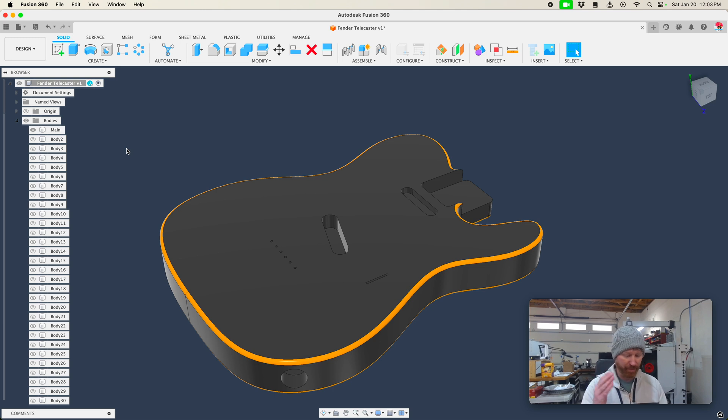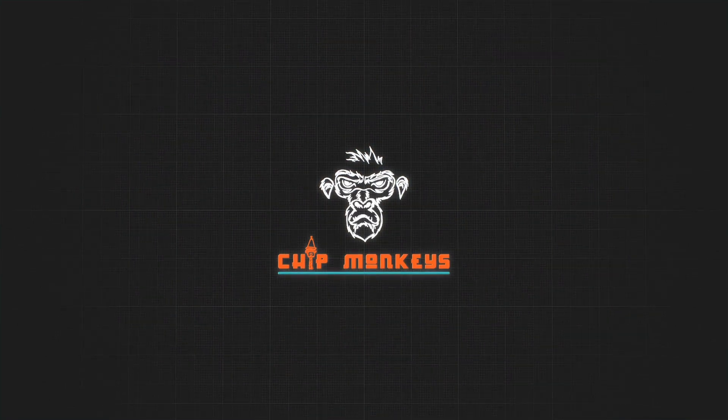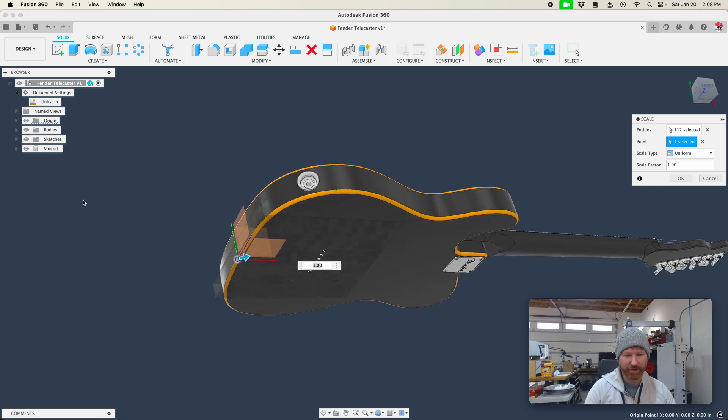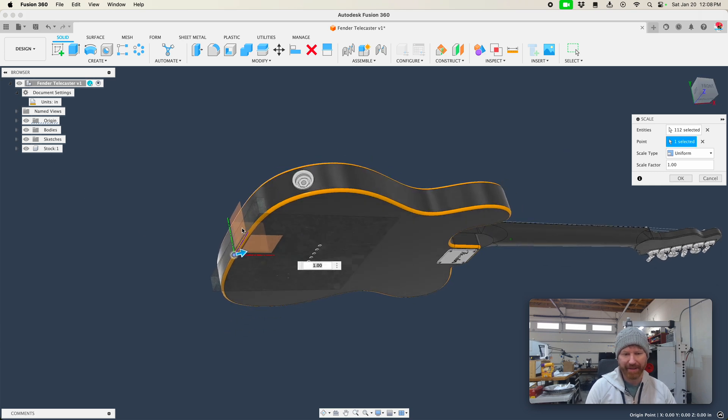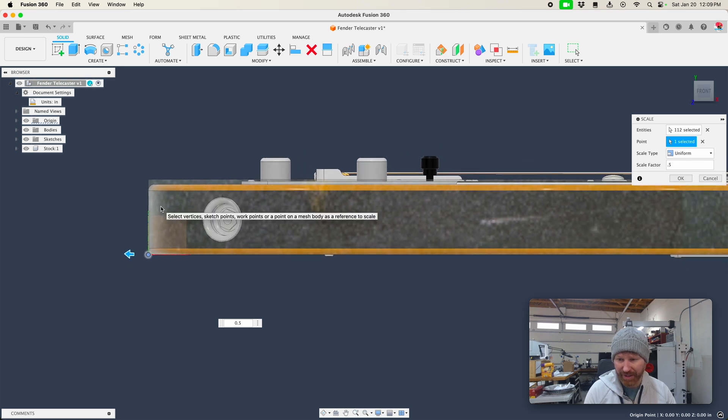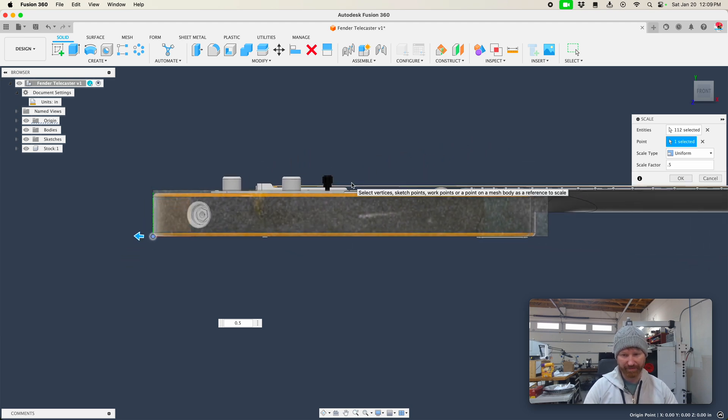To do it I need to get the parts on the printer right now. The machining is actually the easy part — I'm just going to drop this thing in the machine, it'll take maybe 15 minutes. I've got to cut some soft jaws so I can flip it and clean it up, but I think this is going to be a piece of cake. I drew the stock — there it is right here — and then I selected the point, so I'm going to shrink it down. Let's try 50 percent.